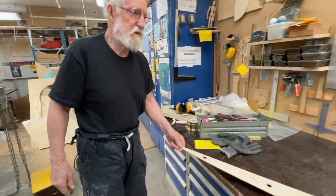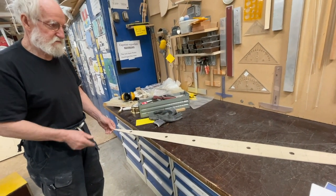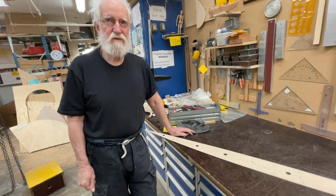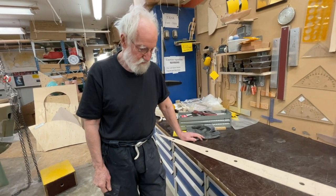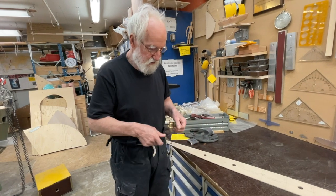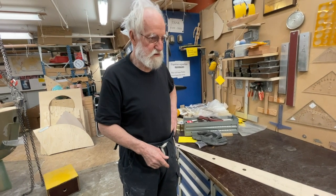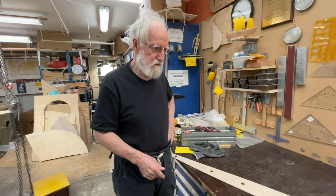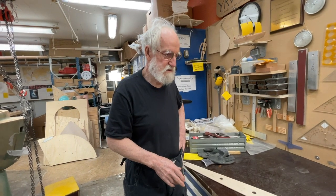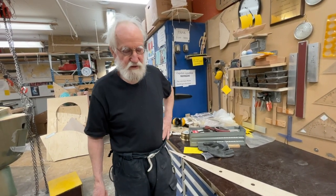The twin keel I had before — I will use the same pattern and build it up to 20 centimeters high. We don't want it too heavy again. I'm going to make this as a pattern, then we're just going to put it in the sand and make it open — open form casting. Then we just put 80 kilos of bronze in the mold and pour it in, and we cannot put more than 80 kilos. So this is the idea.